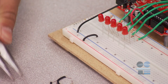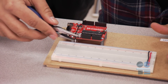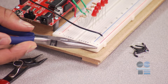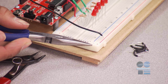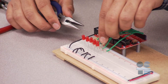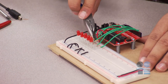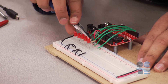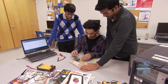The use of pre-made hookup wire is a good idea if you have them. Reduce the number of wires needed by using the common rails along each side of the breadboard. Keep in mind which is the positive side and which is negative. By standard practice, red is usually positive and blue is the negative rail. Keep those in mind to avoid problems later, and be consistent from project to project. Now we are going to connect our components with each other and to the Arduino board. Keep jumper wires nice and neat, use pliers to bend wires into the socket holes, and avoid crossovers as much as possible.